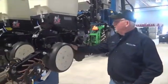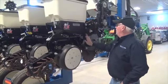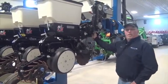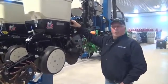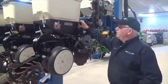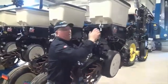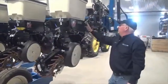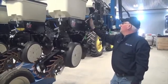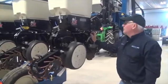First we're going to go over and take a look at the row unit. The first thing people usually look at is the seed wear blade, but there's a lot of other things we should be checking also. One of the main things you want to check that gets overlooked quite often is the parallel linkage. There are eight parallel linkage bolts on each row unit, and underneath each bolt is a bushing. We want to check for wear within that bushing by going around the back of the row unit and pushing up on it. If there's no wear in your bushings, you should be tightening all these bolts up to the torque spec in your manuals.